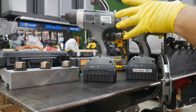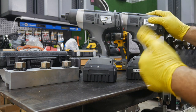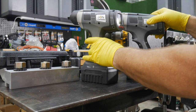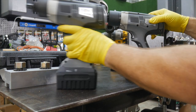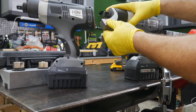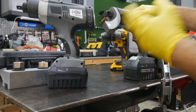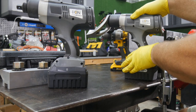The cool thing is there's really no input required to get the torque out of them, and very little feedback is felt through your arm, wrist, or hands. It uses a reactionary arm — though it doesn't always have to. In this case, the reactionary arm applies force against something so the socket can turn and tighten the fastener. It needs something to counteract against to apply that 250 or 700 foot-pounds, or whatever you've set.